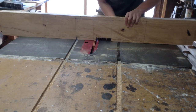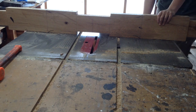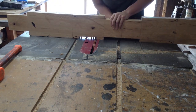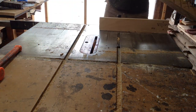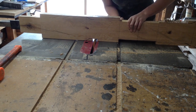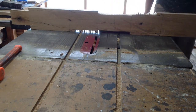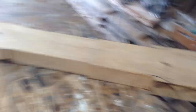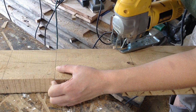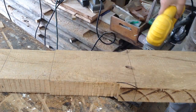That was basically the breadboards. Now I'm jumping back to the stretcher for the table. The original photo had a straight stretcher with no design to it, but I decided to copy the design on the trestles, blowing it up because this is a much longer piece, and transferred it to the stretcher. This is slower work doing it on the table saw, but I don't have a functioning bandsaw and my jigsaw doesn't cut thick material very straight. So I set up the dado stack, made a bunch of curves to clean up, and used the jigsaw for the curve sections.